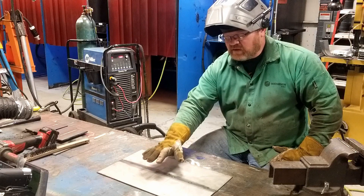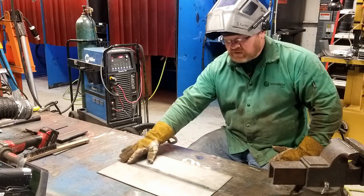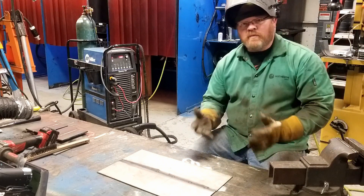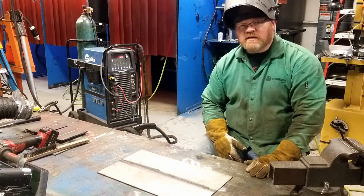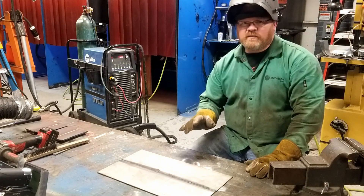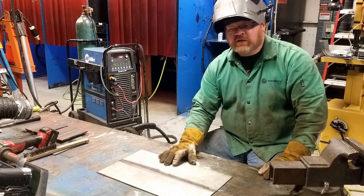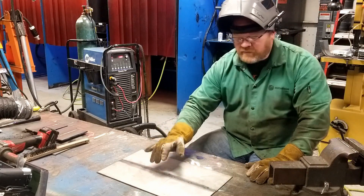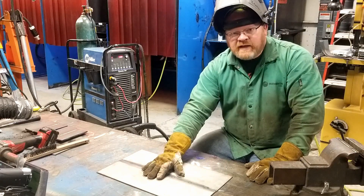What we're going to show today is that this first plate will warp very badly when I weld it up. I'm just going to run a bead down through here — an autogenous weld. The second plate, we're actually going to deform that plate before we weld it. We're going to bend the plate and then weld it with the curve in it, and the effect is that we can get rid of the curve completely. We're going to see the effect of distortion without any controls.